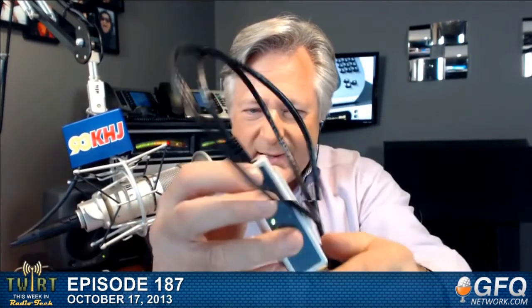Now, what if you had a crossover cable and testing it? What would the display be? If you had a proper crossover, I'm not sure. Well, I know that the green lights would not be in order. They would jump around in some different order. In fact, here's the other end, and it's also scanning.